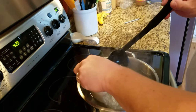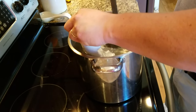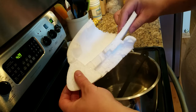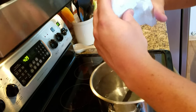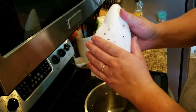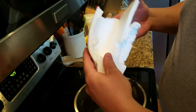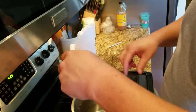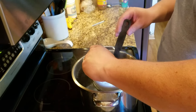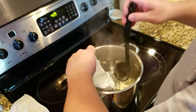The water seems to be getting a little bit more reasonable temperature-wise. I'm just going to hold it in there. Of course it wants to float so you have to kind of be prepared to hold it tight. And then this bulkhead — this bulkhead we can straighten it. And eventually this plane will relax back into the pre-crash configuration largely. It's not going to be an exact thing but it's going to be close. You want to stay off the bottom and sides of your pan if you can because they will transfer a little bit too much heat.